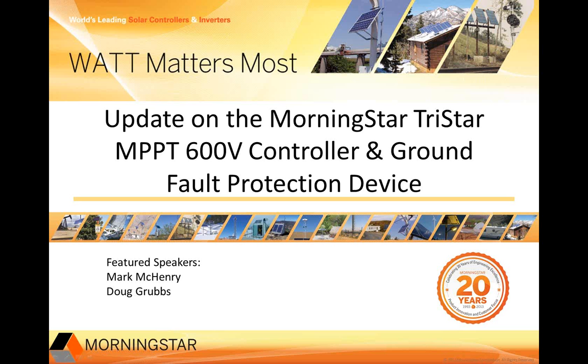And today we're going to share with you in this webinar some information and updates about a couple of Morningstar's newer products, the TriStar MPPT 600V charge controller and the Morningstar ground fault protection device. Both of these products became available late in Q4. We developed the ground fault protection device product, or GFPD, to support the 600V charge controller because, in accordance with U.S. Electric Code, a ground fault protection device is required when you have an array on a dwelling.